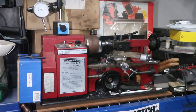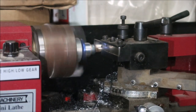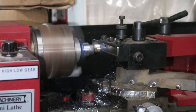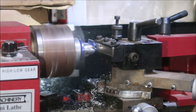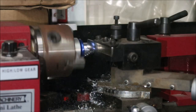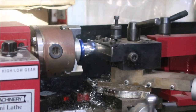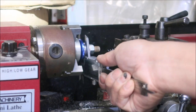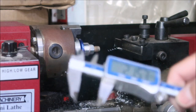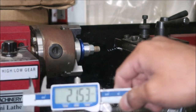Here's a close-up. If you don't have a lathe, the next best thing is a grinder or Dremel grinding bit — the lathe is just more precise. I'll keep checking with the caliper every once in a while. I need to get to about 18mm. Right now I'm at about 22mm so I've only done about half a millimeter — there's a lot of work left.